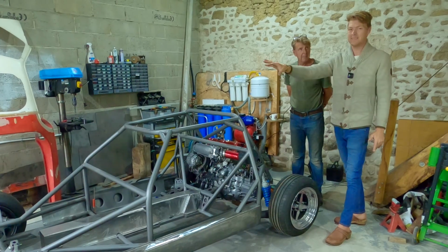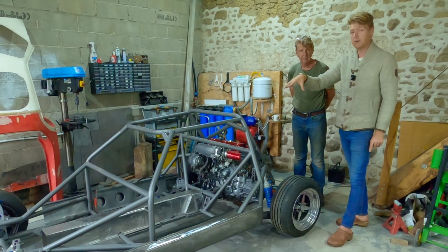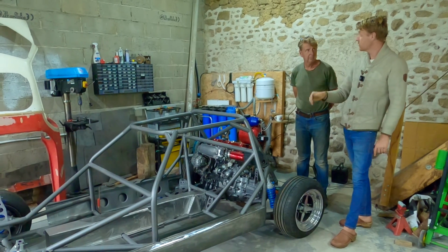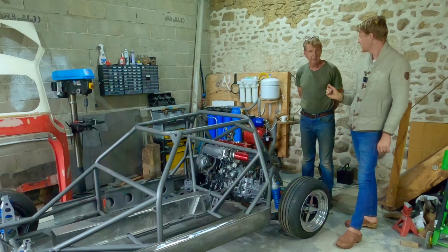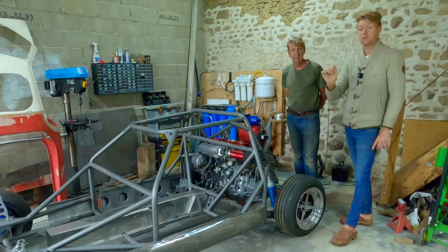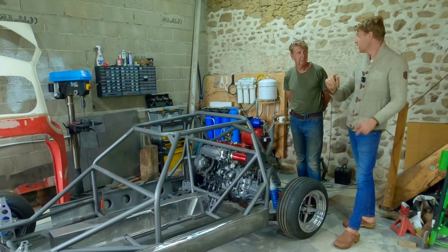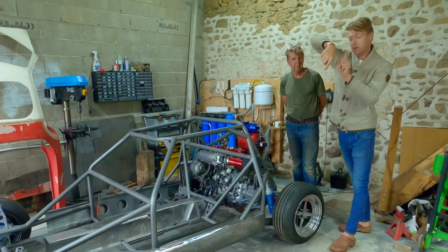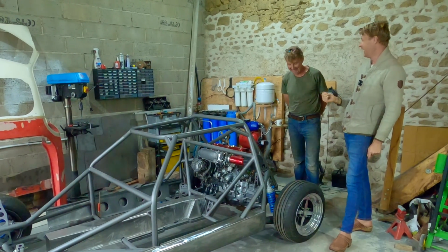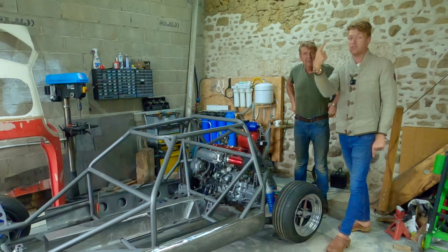But we want a slightly rearward weight balance because such a short mid-engine car has a really small moment of polar inertia. So basically it wants to spin like a top. There's a really good video of a GT40 crashing at Goodwood, and it basically spins like this. It does the Mission Impossible 2 thing. Yeah. But a mid-engine car does that. It wants to spin like a top.